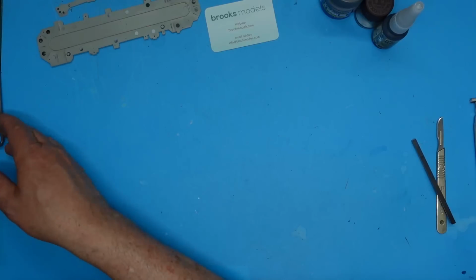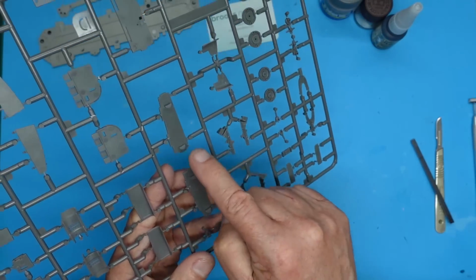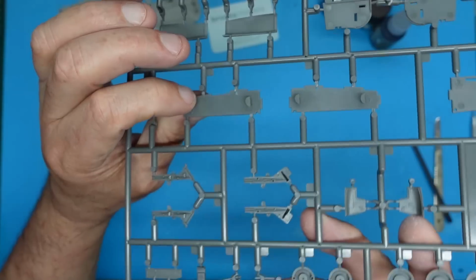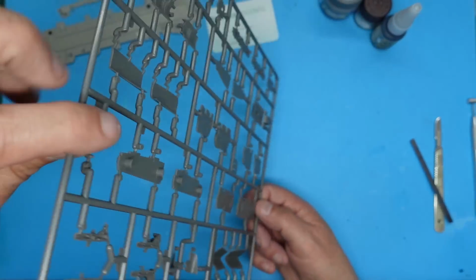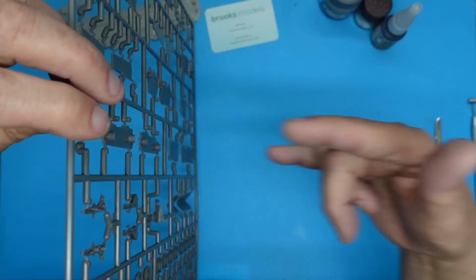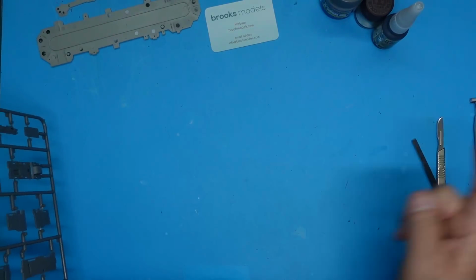Another one to look out for, and with Airfix they actually tell you to remove them. You can see here you have these great big raised D-shaped pins, and they are called Z-pins, and they are part of the ejector pin, and they're often there. So basically, as the sprue is ejected, the ejector pins will stay out, and the sprue will hang on the ejector pins, and then the operator or whatever can just take it off the pins, press a button, and it starts to cycle again.